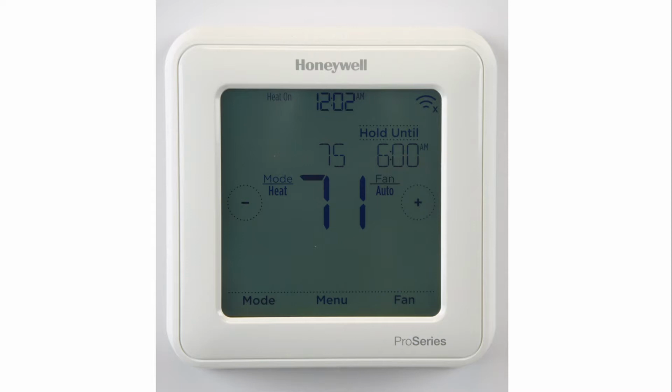If your thermostat is battery powered and calling for heat, but the heat is not running, it's only natural to try turning the thermostat off or turn the set point below room temperature and then back on. Sometimes when you do that, the heating system will start up when the thermostat calls for heat again. When or if that occurs, it's pretty easy to think it might be something with the thermostat that causes the furnace to not come on. That may or may not be the case.